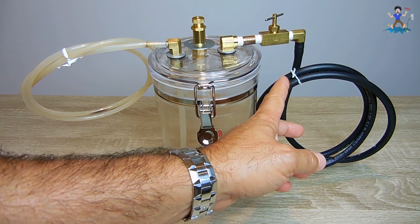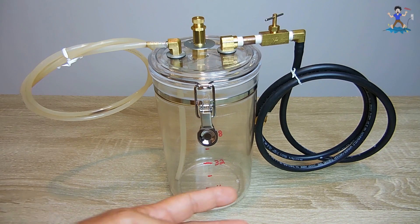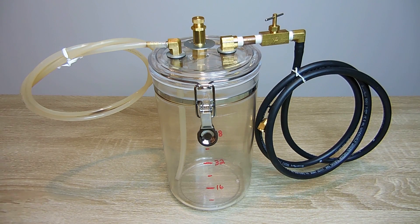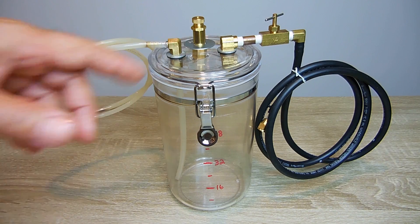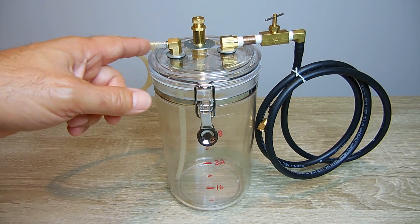This side over here that connects to my vacuum pump is vacuum line that I picked up at a local auto parts store. You're going to require around 5 feet of that and I use 7/32-inch ID. Now let's take a look at the fittings. You do not have to use the more expensive brass fittings like you see right here. These pieces can also be found in nylon and it will save you a lot of money.